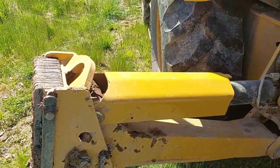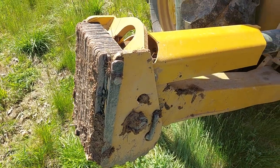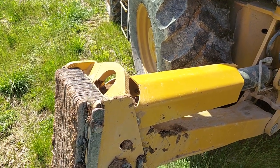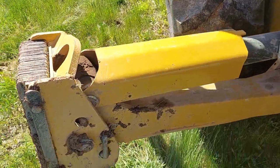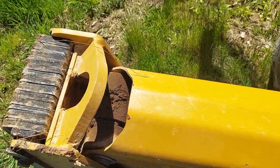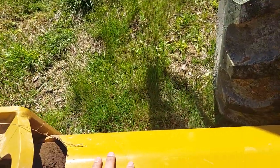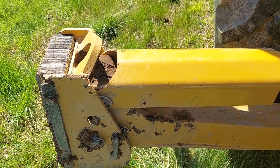The other awesome thing is when you bring your outrigger all the way up and want to shake your dirt and rocks off, this thing is like swinging a baseball bat — it just bam, takes it off, throws the rocks and dirt off. Another cool thing CAT did is put a big, nice metal plate guard over the top of your hydraulic cylinder. So when you're throwing dirt off or get your outrigger sunk in mud or soft ground, all that material is not coming up and scarring your cylinder. That's really good design thinking.